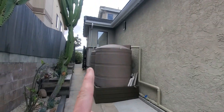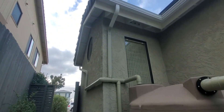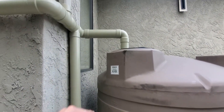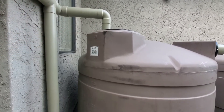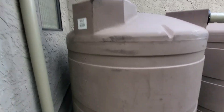So we plumbed in two 865-gallon rainwater harvesting tanks and tied into these two downspouts from the gutters. The first bit of water goes down this pipe, which is the first flush device. I'll show you that on the other side a little more, and then once that fills up, the cleaner water goes down into our tank. There's a screen there to make sure debris, animals, or other things don't get in the tanks.